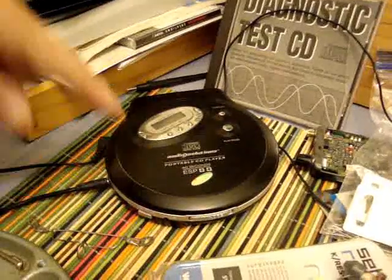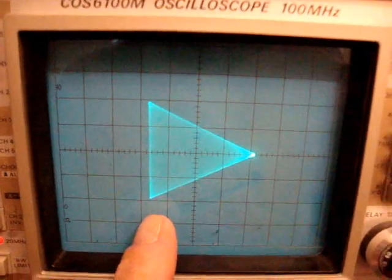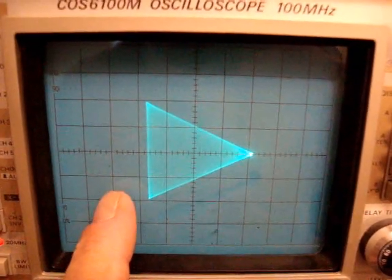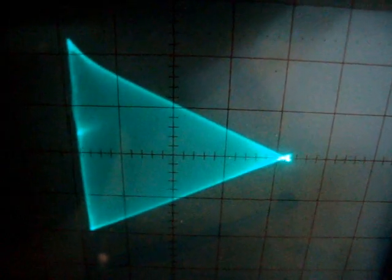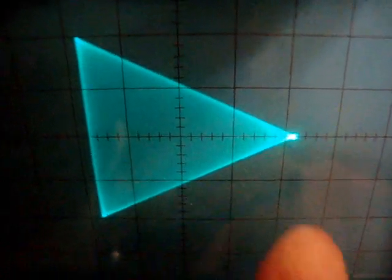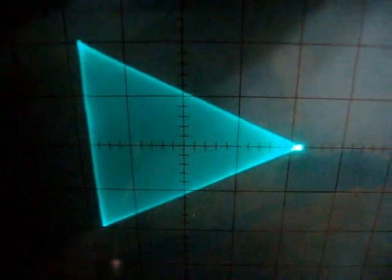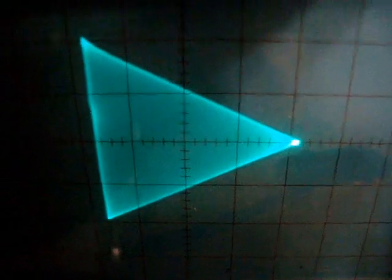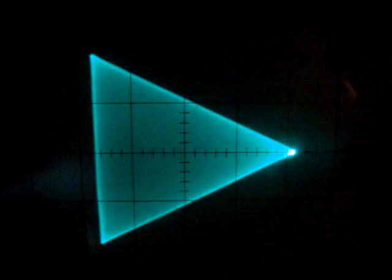Right now I'm playing a 1 kHz tone. This is a trapezoid display which compares the actual audio signal with the RF signal. There's zero modulation and turn it up and it'll over-modulate. Now with this kind of modulator, you'll notice it will not go to flatline. It'll splay out the other direction, but that there is perfect 100% — that's a perfect trapezoidal pattern.